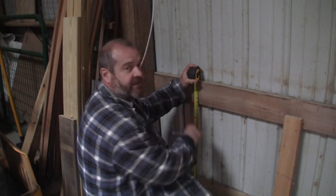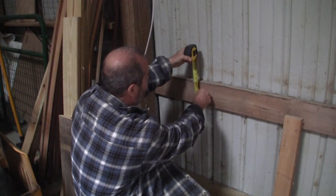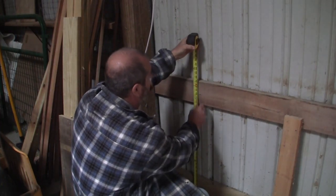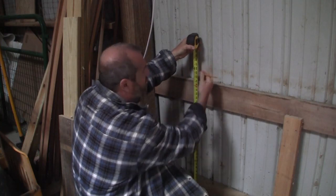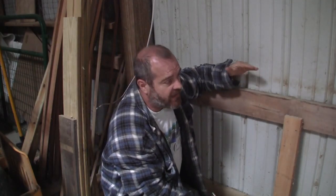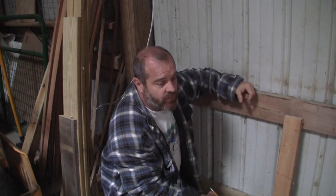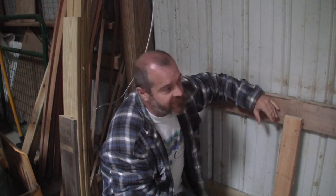We're looking at 30 inches to be where the top of the table is. The rails on the side are 9 inches tall. So that gives you a total of 39 inches tall, which the table that we have currently for the table saw is 38 inches tall. So that would be a total of 1 inch taller with the rails. The rails have to be taken into consideration. They sit like, I don't know, 5 feet apart, something to that effect. So when you're leaning in, you have to think about being able to reach over those rails to get to the center, into the middle of the cut. So I think bringing this down a little bit is going to be good.